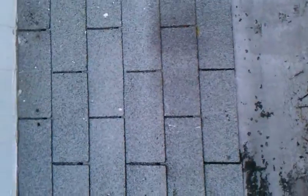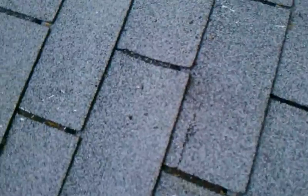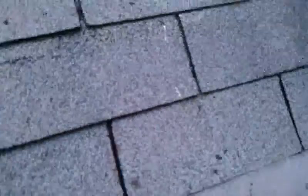You'll see some nails there — that's because I pulled a few nails out when I was investigating. I looked underneath and found moisture all up through here. If you have a leak near a transition, it's normally coming in at the transition or higher.